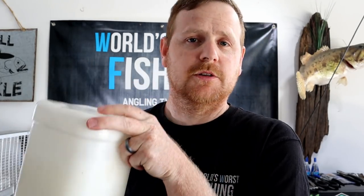The owners of Dead On Plastics recommend that if you buy in the one-gallon jug, transfer the plastic to some sort of open bucket where you can use a hand-mixing apparatus or the drill bit — that promotes a better stir overall. However, if you're going to stay with the one-gallon jugs, don't get violent with it. Take your time, leave it flipped upside down 30 minutes before use, then do a few slow rotations right before pouring to get a good mix without agitation.